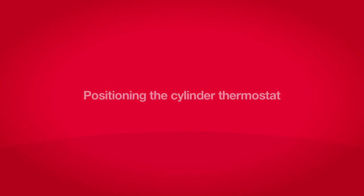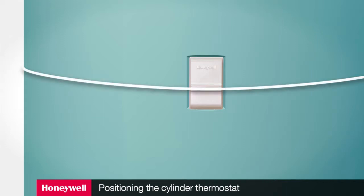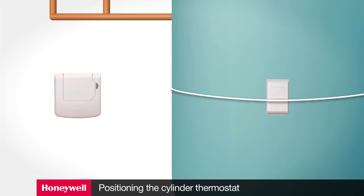Positioning the cylinder thermostat. Carefully cut away an area of insulation one third from the bottom of the cylinder. Make sure it's large enough for the wireless cylinder thermostat to be placed against a metal area of the copper water cylinder, and that the small temperature sensor on the rear of the device is in solid contact with the bare metal. When mounting the thermostat to the cylinder, make sure the spring clip that surrounds the thermostat is tightly holding it in place. The wireless transceiver is not contained within the cylinder thermostat as the metal water cylinder will affect wireless communications. Communications between the thermostat unit and the transceiver are by a low voltage single wire that needs to be installed before the system is fully commissioned.